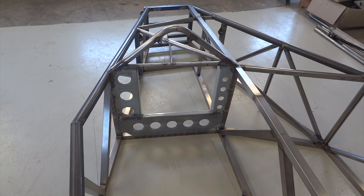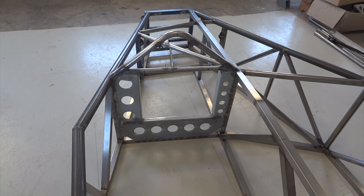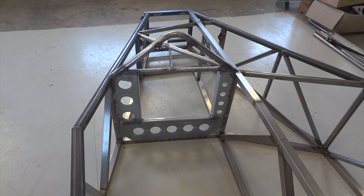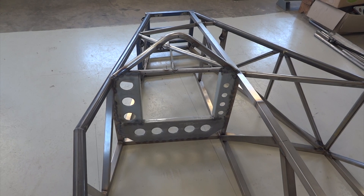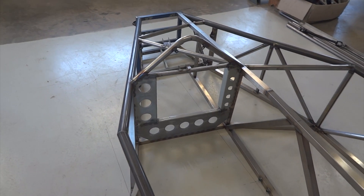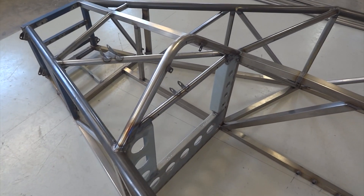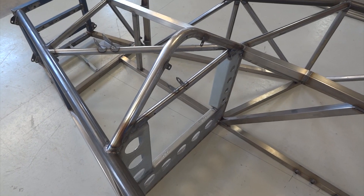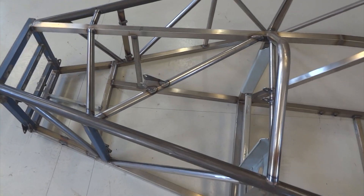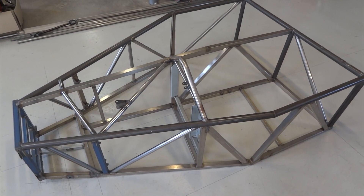You can see the little hoop above, which will be the instrument panel, and to stiffen up the hole where the driver's legs poke through, there's some 1.2mm steel reinforcing around the edge. We've also got some steering column brackets to get to later. That's the front part of the chassis pretty much done.